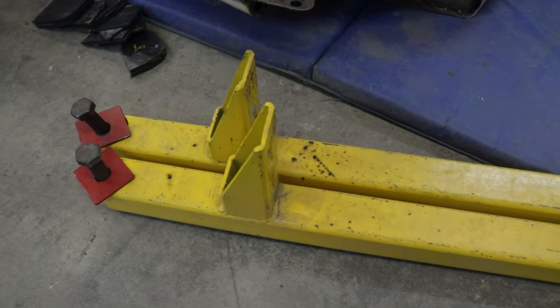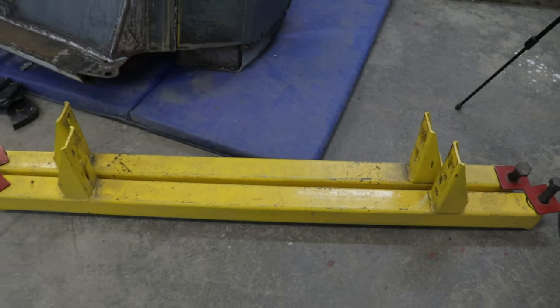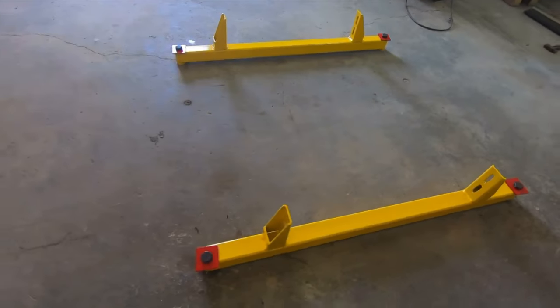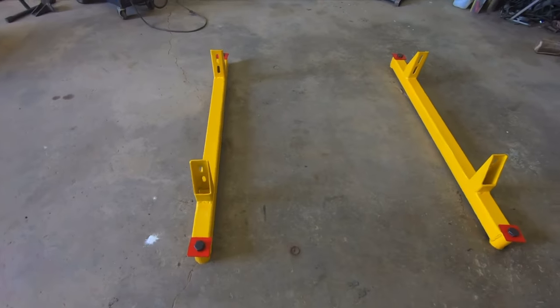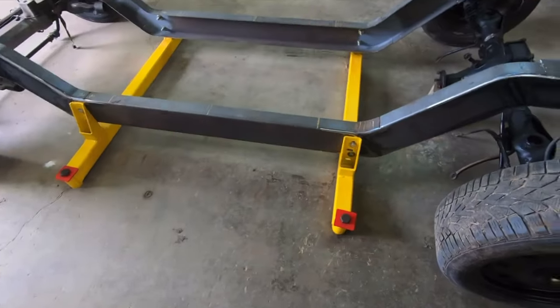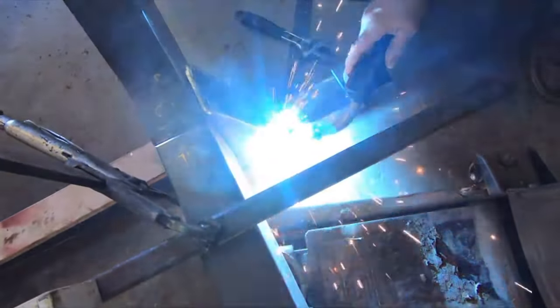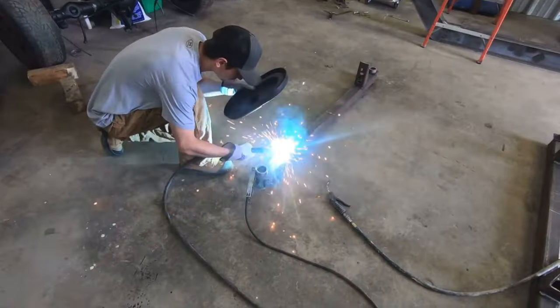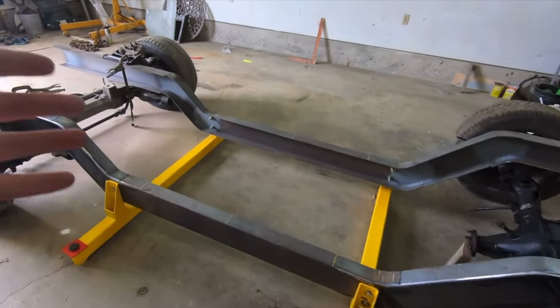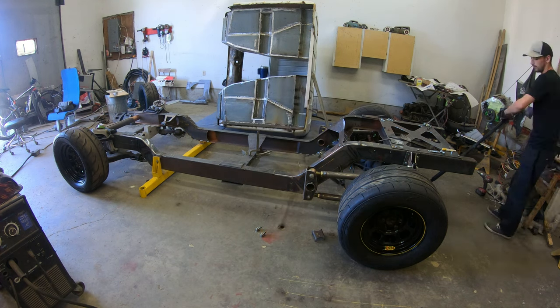Let's talk about a frame jig — this is crucial. You're going to need this before making any crossmembers or mounts. Basically it's a jig that you can mount your frame to and it'll be secured for the entirety of the build. Once everything is secured and solid, you'll know your measurements won't be thrown off if you bump into anything. I would say building a jig is a test of what's to come — if you can't make a jig, chances are you won't have a good time building a chassis. I used a simple square tubing base with square tubing mounting brackets cut with a plasma cutter. The jig bolts directly to my frame and then bolts directly to the ground using threaded holes in my shop floor.